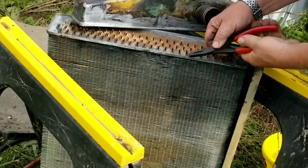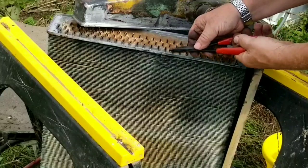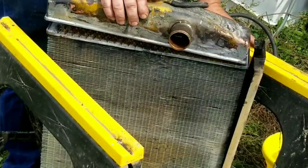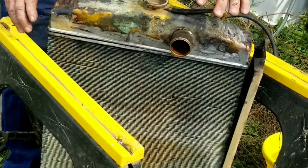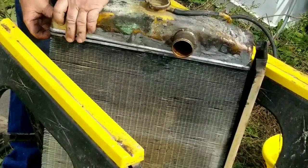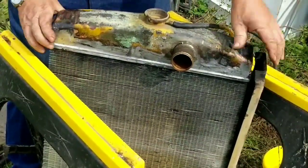If the gap is too wide, the solder will just flow into the header. We won't be able to bridge that gap or fill that joint. I'm not sure what the correct width of a gap is, but somewhere a little more than touching and probably less than a 16th of an inch.